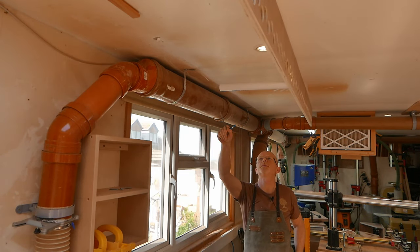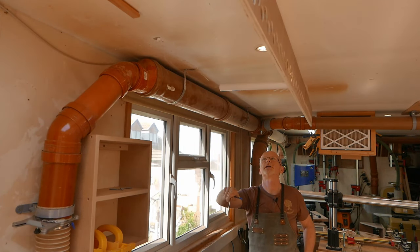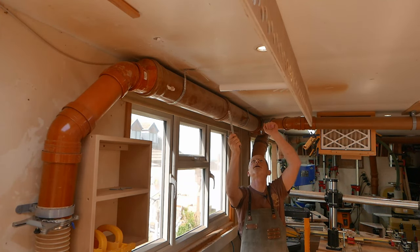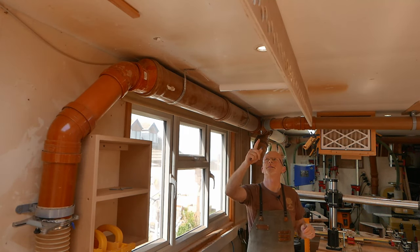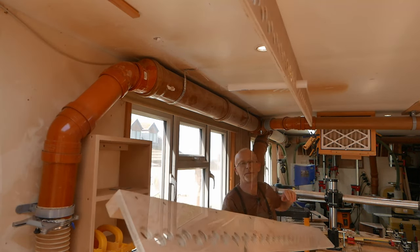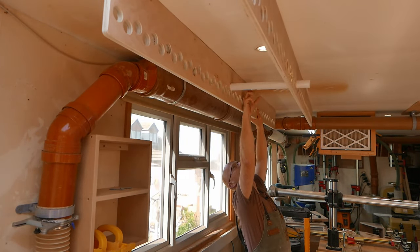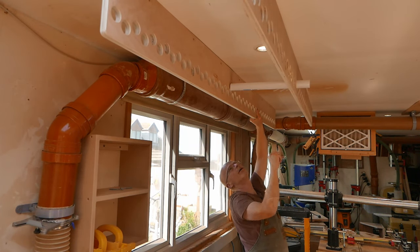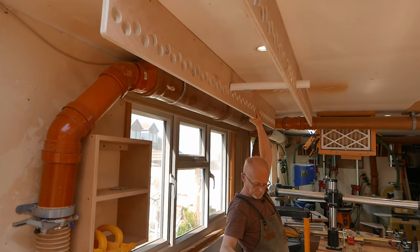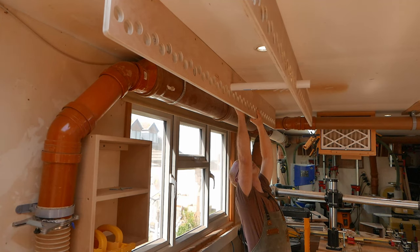So I've just squared down from the ceiling to the back of the pipe, which is the back of the ply, which I won't be able to see because the support rail is on it. So I've measured forward 18 mil to represent the front of the ply, so that when I offer it up, I should be able to see. But I'm now wondering whether I should have marked the back of the rail, because I'll be at the back. I might do that as well. I may be forced to mute this bit if there's too much old man grunting. No grunting yet.